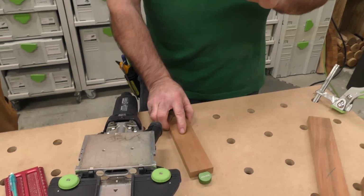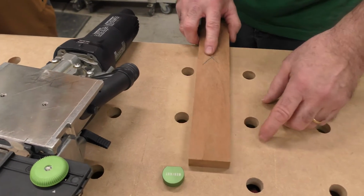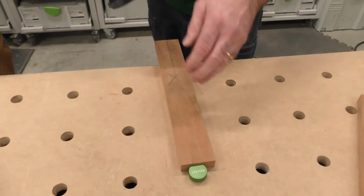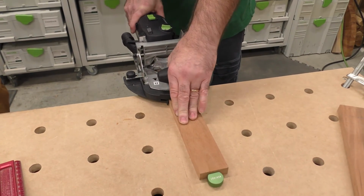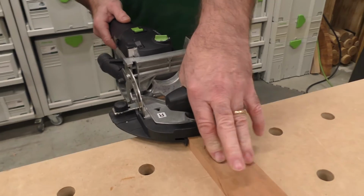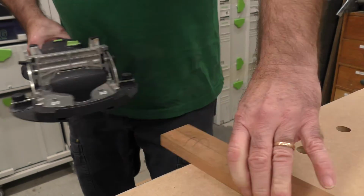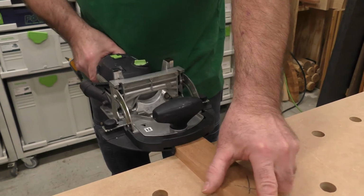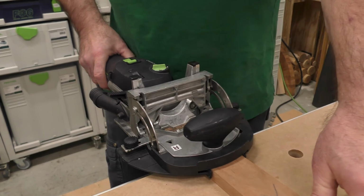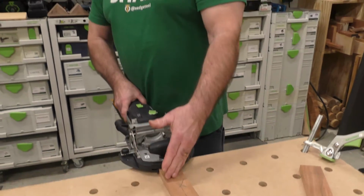But here's the thing I want to coach you on. That impedes the forward momentum. Yeah, if we set it up, you could put 2 clamps on here. But you know what, going through this, what I want to point out is this. When I do this, and this is what I mean by hand pressure, my thumb's here on the Domino, and look where my fingers are. It's right here. So I could take that plunge and just go like this. I call it helicoptering, and do the other side like this. But I'm using a stop and hand pressure and thumb pressure. It makes it wicked easy.